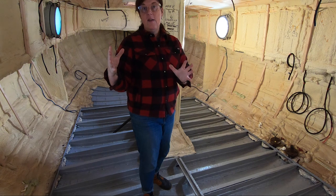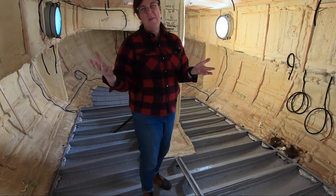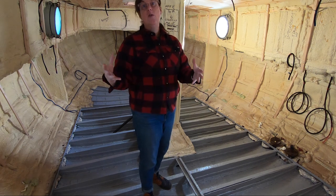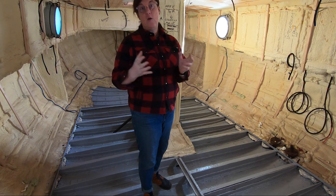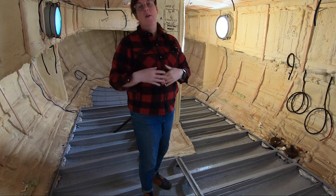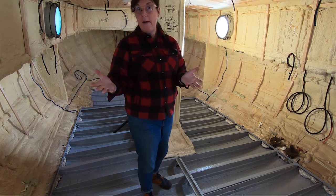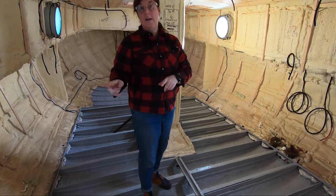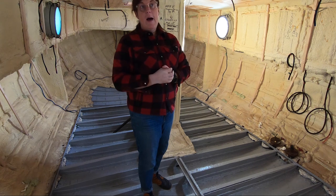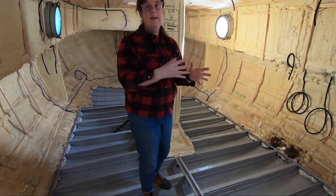So I don't really fancy that very much. So I'm going to try and get the inverter in and get the battery bank in. For a start, the batteries need to be continually managed anyway, so they don't deteriorate. But also, I'd like to have that all set up so I can have some sort of power redundancy. So if the shore power goes off, I can still have mains power. Not 24 volt yet, but still the mains. So all the sockets will be on. Also, it means that I can have an uninterruptible power supply for my heating system.